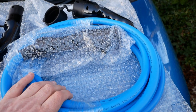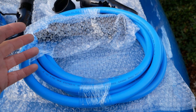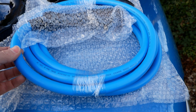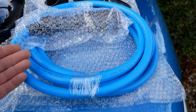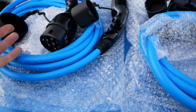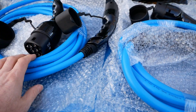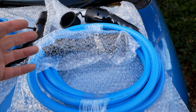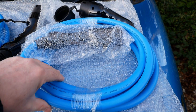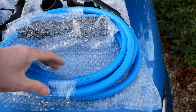The next type is the three-phase cable - and this is a mistake people often make. If you're buying a cable for a car with three-phase charging, like all Renault Zoes or a BMW i3, ideally you want a three-phase cable. That way, if you plug into a public charger that has three-phase, your car charges at its maximum rate. A 32 amp cable is fine for charging at home on a seven kilowatt home charger - since 99.9% of people won't have three-phase at home - but at a three-phase public post, having the right cable is a real advantage.